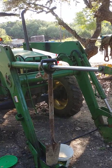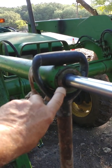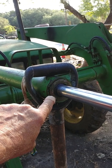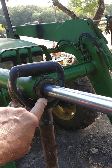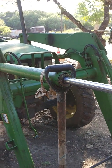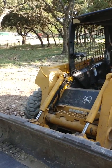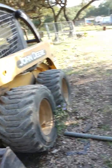The mistake was with the seal closest to the end of the hydraulic cylinder — we put that seal in backwards. When you take the old seals out, make sure you note which way the seals face so you can put them back correctly. Once we turned it back around, everything worked just fine. Also, a sharpshooter shovel held up the cylinder arm and works as a great tool, allowing you to work by yourself if needed.